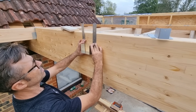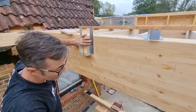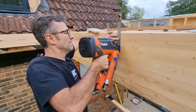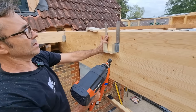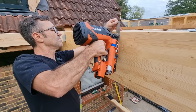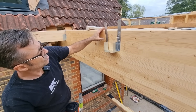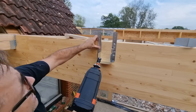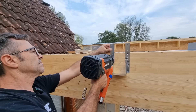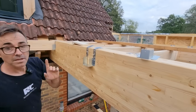To fix it I'm going to sight it through, pull it around to the lines, and use a positive placement nailer — a PPN nailer. The pin on the end holds it exactly right — a brilliant tool. I'll sight it through and sight it up for each one. So with all my hangers in, when I'm building an aperture or series of openings I'll put the inside one in, support it on the other end, and start filling everything in.